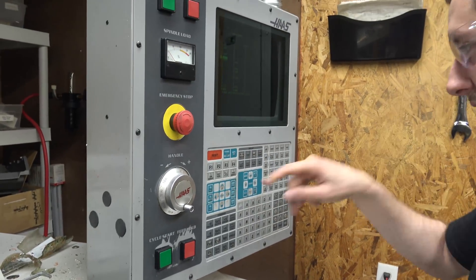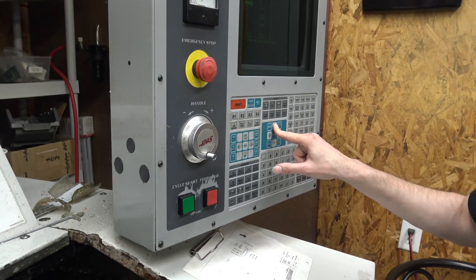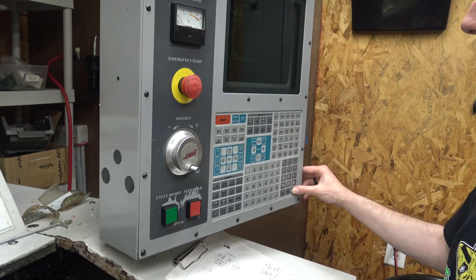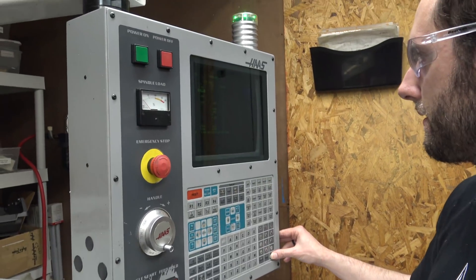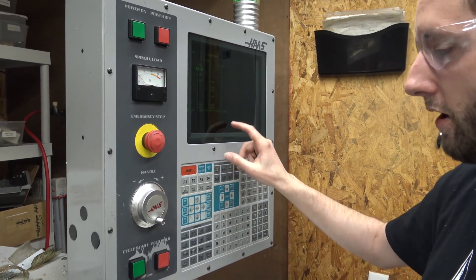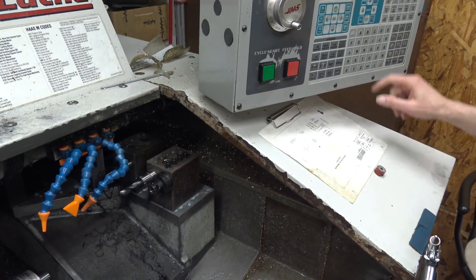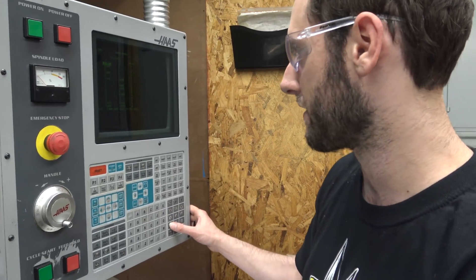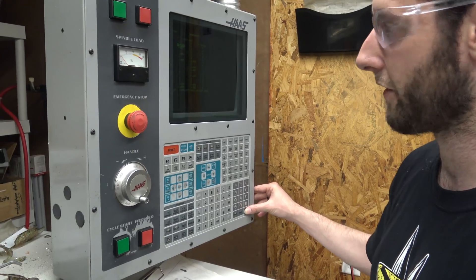You should probably make the ID a little bit smaller — I'm going to make the ID a little smaller. I went positive, and positive actually makes it smaller because my tool is upside down. Because I made the ID smaller by one tenth of a thousandth of an inch, I'm going to make the OD a thousandth of an inch smaller also.